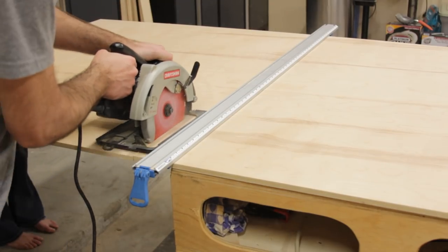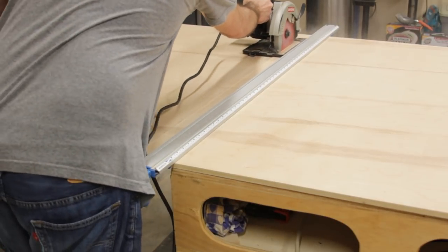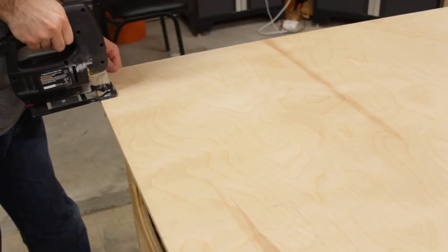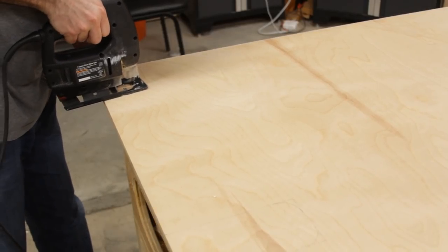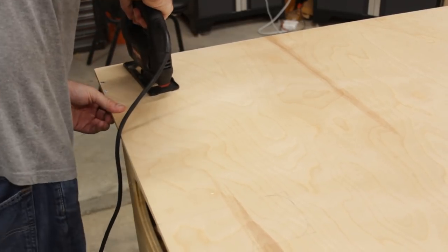The final step in assembling the tabletop is to cut the bottom to size. I used 1/2-inch plywood for the bottom as it really doesn't provide any structural support. I used my jigsaw to cut out holes for easy access to the nuts and bolts connecting the legs and the table to the base.